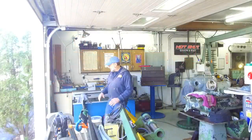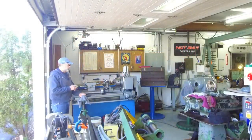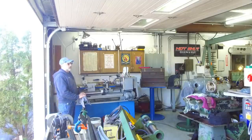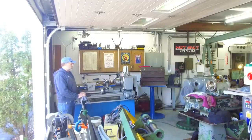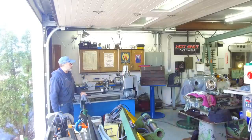Okay, we're all set up here. We got the roller stand here on our mark. When we did the other 3-inch, we put it in here. We marked on the floor where this is at. This shaft out here is 224 inches long. So we need to get 112 inches. 112 inches just fits inside here before it gets to the taper.